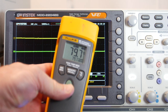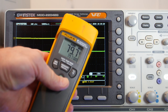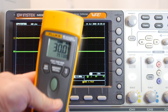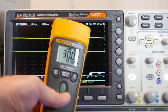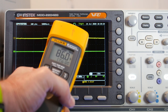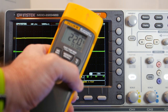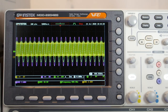Something interesting: I smelled something getting hot. I realized it was the load resistor at 79.7°C — that's 175.6°F — after being off for a couple minutes. The transistors and inductors mounted on the board are at 30°C, or 86°F — just barely warm. The shop is at 22°C, so only about an 8-degree rise on the amplifier components.